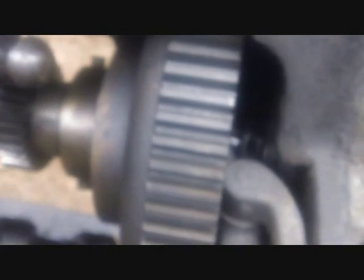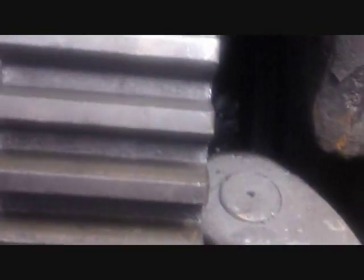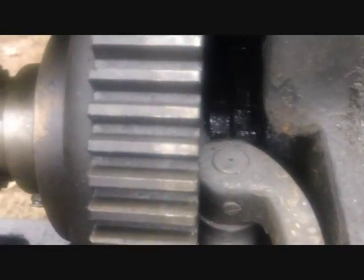When I tap on the back it stops dead. I noticed there's a screw head right in there — I wonder if that's a locking screw. I got a screwdriver and loosened it, and that did make the spanner nut easier to turn. The process is: turn the rear spanner nut a little, turn the larger front nut a little, tap the shaft a bit, and repeat. Eventually the nuts reach the end of the threads and become completely free, at which point you can tap out the whole shaft.